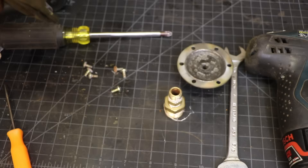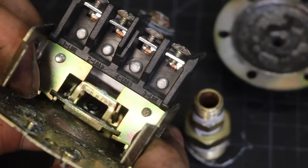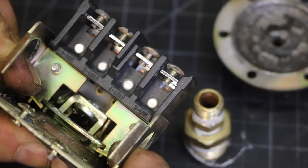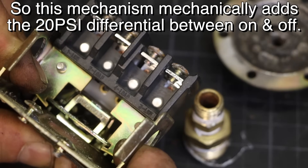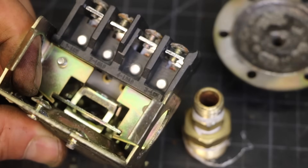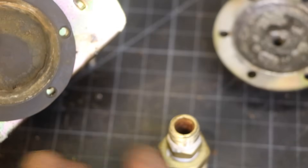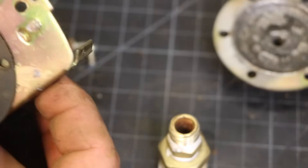So why the fancy mechanism? The idea is that when the pressure gets too low the pump needs to turn on and then continue running for about 20 PSI and then turn off. So if I push just hard enough to trip it — there — now I start relaxing and letting off pressure, but it's not going back yet. Then it goes and it starts again. Otherwise the pump would just be on-off, on-off, which would be bad for the pump. This gives it that range of pressures that it operates through, all in these springs and this mechanism. The reason mine was not working is because there was no way for the water pressure to get to this diaphragm. So as far as the pump knew, the pressure never went up — it never saw any pressure and it wouldn't work. It's dark now, but tomorrow I'm going to put this back on the pump and I bet it's going to work.